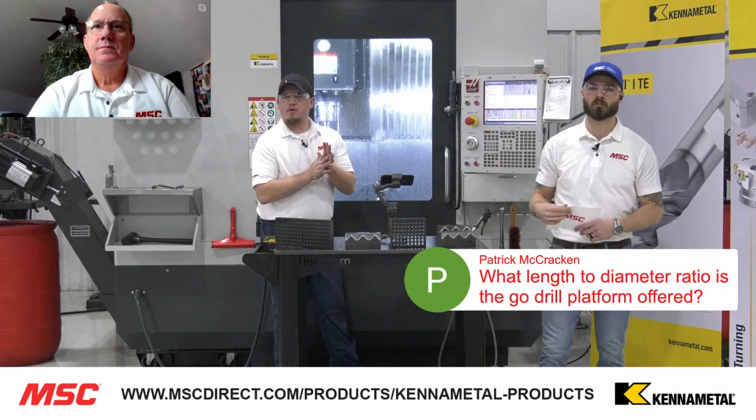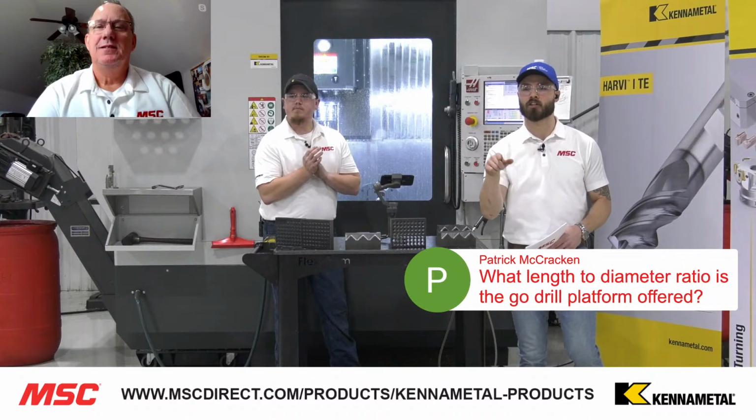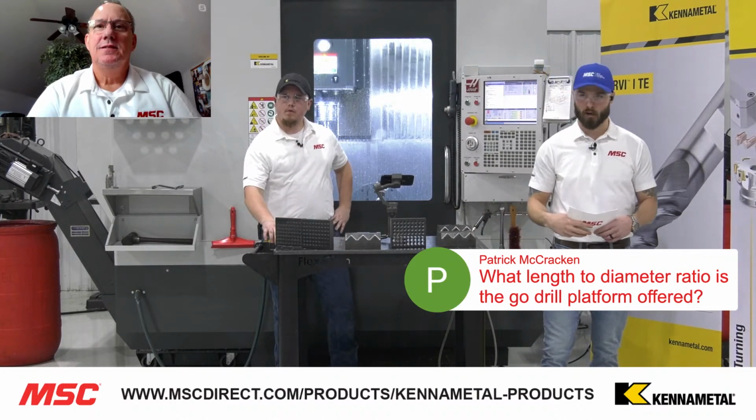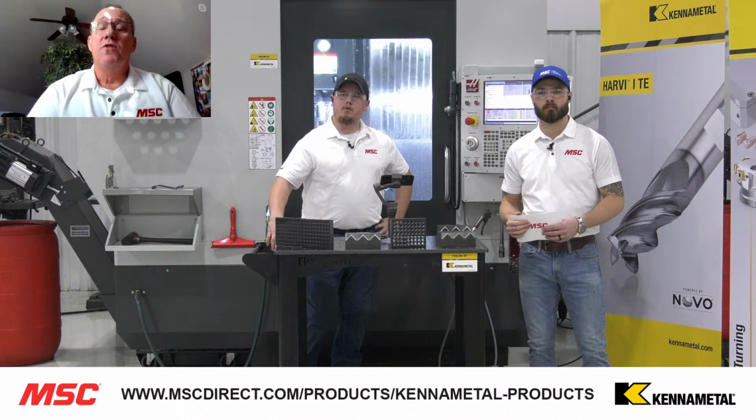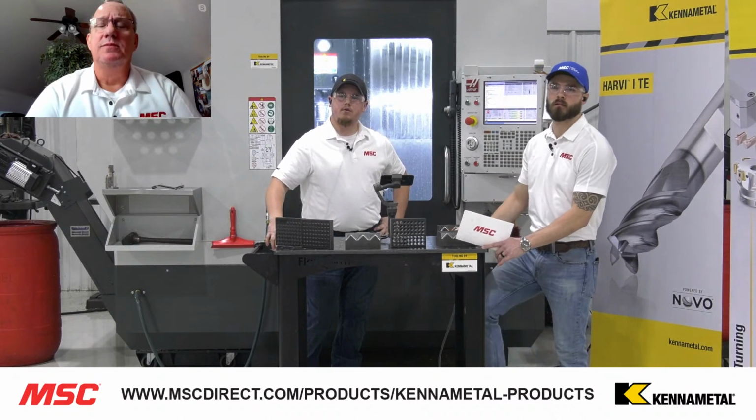Thank you so much, Patrick, for joining us and for your question. His question, Tony, is what length to diameter ratio is the GOdrill platform offered? Yeah, they're actually offered in 3 times diameter, 5 times diameter, and 8 times diameter.